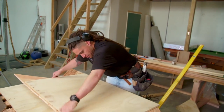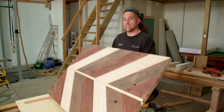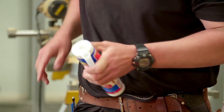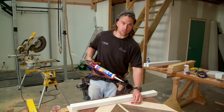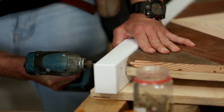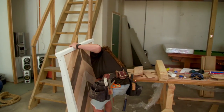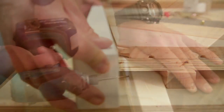Kaamutu tēnā. Once they're in place, we flip it over and saw off the overhanging edges. Te ahua ni, kōpai tēnā. We're all done here. Now I've got to put the edging around the outside. I'm using a fast-curing Gorilla Grip — the trick is not to use too much because it foams up and we don't want it coming out the sides of the timber. Secure with 75mm screws and add the other two edges. Nā kōoti — all done. But wait, there's more. Me hanga te tahi ano — we have to build another whole footboard the same way.